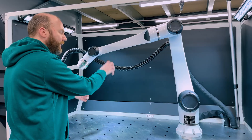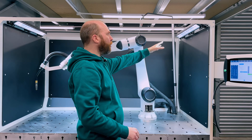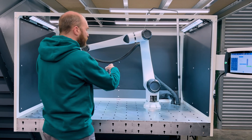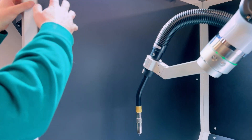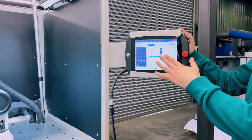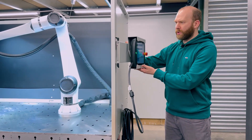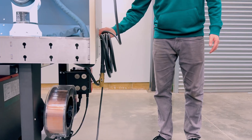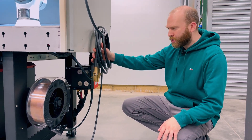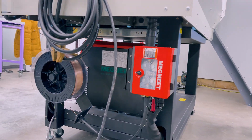So you can fix in jigs for repeatable jobs. The robot can be put in any position and it can work outside of the table boundary too. Lights on both sides run on a 24 volt system and they're super bright and really high quality, so it definitely lights up whatever you're going to be doing. The side panels have an anti-reflective panel on the inside. There's a full touchscreen controller where you program the robot — it's super easy. That folds round to store neatly away. There are hooks on the side to easily hang the cables and the earth clamp if you need to clamp external trolleys or external workbenches. MIG welding wire on a 25 kg spool, with the wire feeder set nicely.